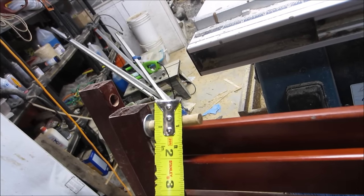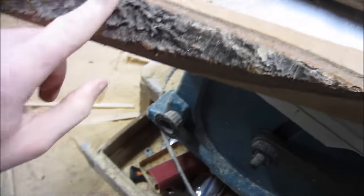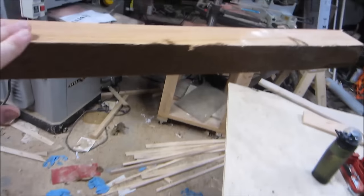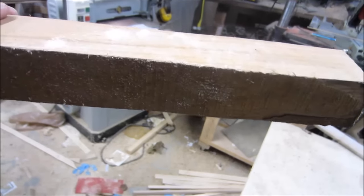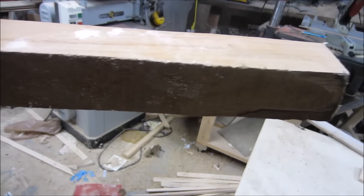I'm going to do two inches by one and a quarter, I think. So I have this piece of buckthorn here and it's a rough cut right off the mill, so I'm going to have to do a little bit of finishing work on it, but as you can see we have some neat live edge here. I'd be tempted to use this section just to have the live edge. If you've never used buckthorn, I would compare it to something in the apple family probably. It's a softer hardwood — somewhere between pine and oak I guess. Looks like some nice grain pattern here.